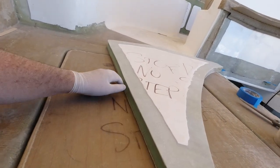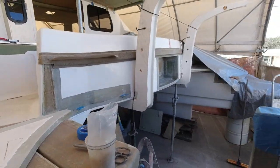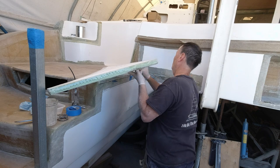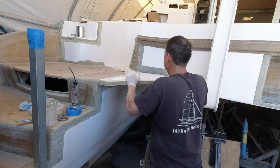This step here has to be put in place. I've just spent a good hour or so sanding the margins here around the outside and I've also cored this slightly because I'm going to use epoxy to glue it in place like I have on the other side. Basically I'm going to glue that onto the boat - I've just cleaned it, prepped it, I'm going to put it in immediately and then I'll glass it in, to avoid any chance of anyone getting hurt.